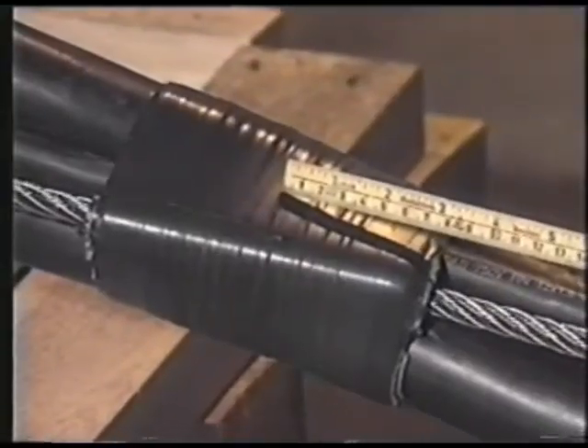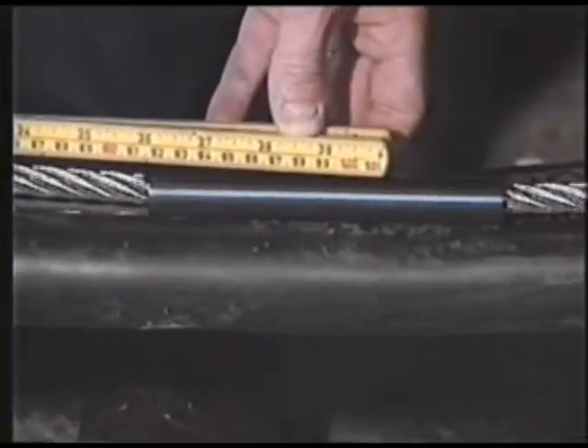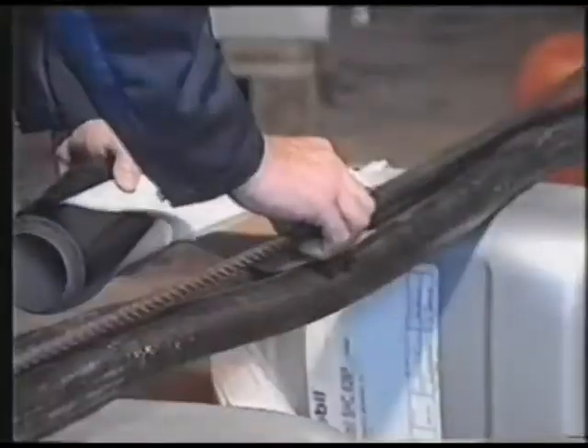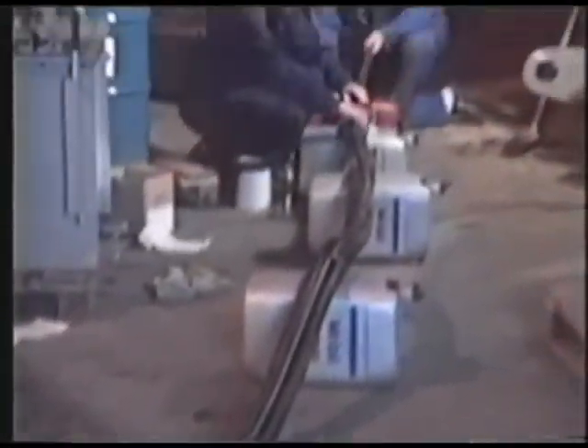The rest of the wrappings shall be done with a distance of 1000 millimeters between the plastic tubes' center parts. The number of tubes required is dependent on the depth of your installation — please refer to your installation drawing. Make sure that the cables and the wire are parallel throughout this operation.